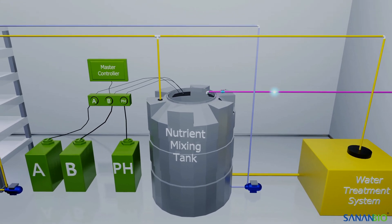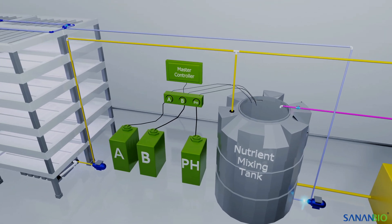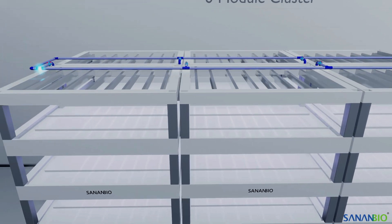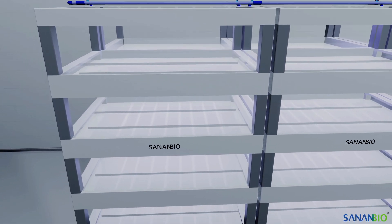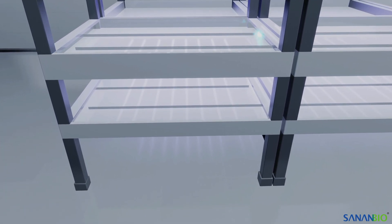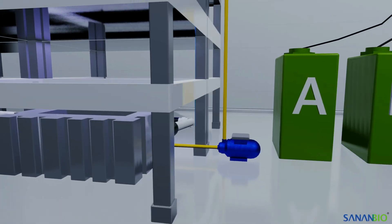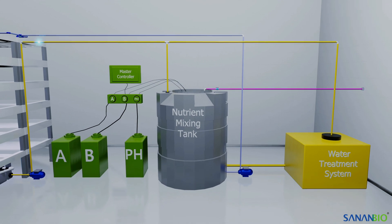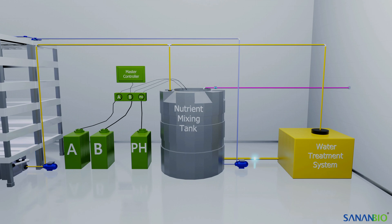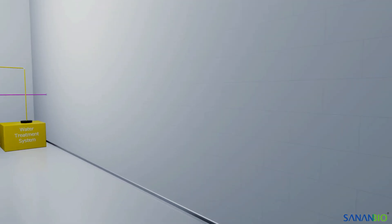Fresh water is fed into a large mixing tank where a doser combines nutrients and acids to achieve proper EC and pH balance. Nutrient water is pumped to the cluster via overhead delivery plumbing that distributes to each module by the pressurized delivery loop. Ball valves allow for manual adjustment to achieve the necessary one gallon per minute per module flow rate. Water exits the modules and flows into the under-module reservoir through the collection plumbing. A pump located at the under-module reservoir sends the nutrient water back to the nutrient mixing tank for EC and pH adjustment. At the end of the growth cycle, the water is either cleaned and returned to the system or disposed of in accordance with local regulations.